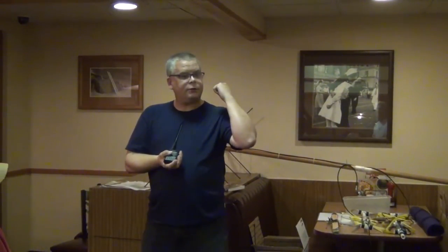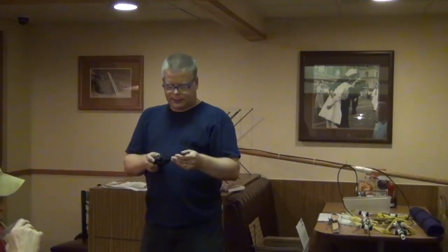You can use a technique called body shielding, where you hold the radio against your body and spin around in a circle, like 360, and whenever you find the weakest signal, that's typically because your body is blocking it and tells you that it's behind you. So that's body shielding or body fading. If all you have is just a handheld, you can use that as a method to hopefully tell a direction from where you are.